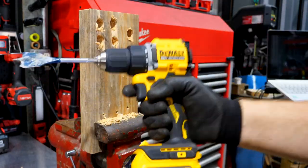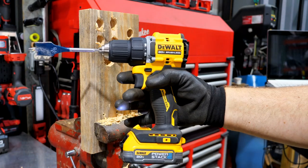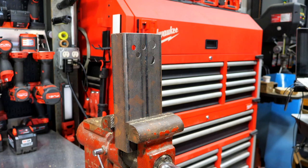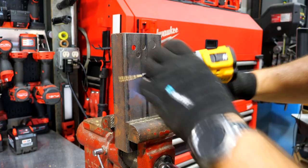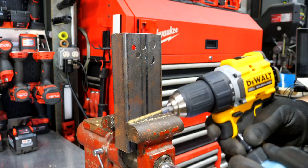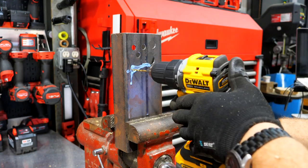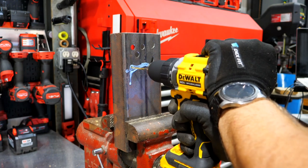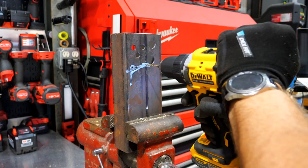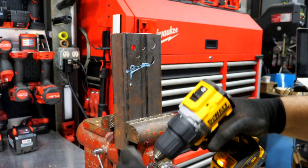Gotta be careful on a drill that doesn't have an auxiliary handle. That's my own stupid mistake. And now we've got some steel back up here. This is a little thicker than 1/8-inch steel. Very run-of-the-mill titanium-coated drill bits, so nothing special, but they should be decent drill bits. And again, in high. So it should not be any issue in drilling steel.